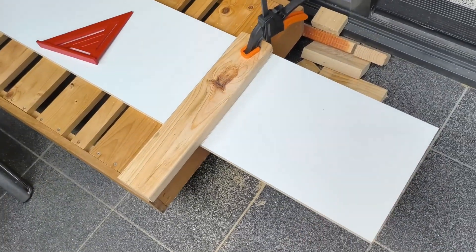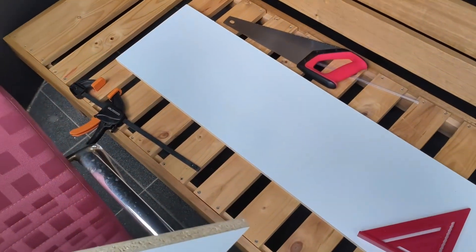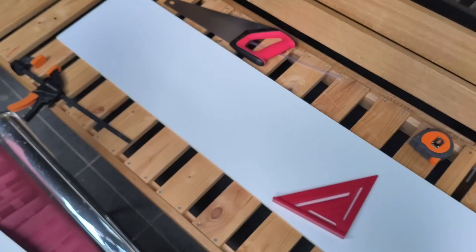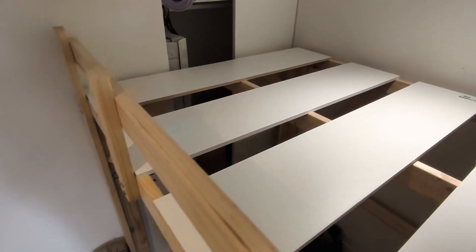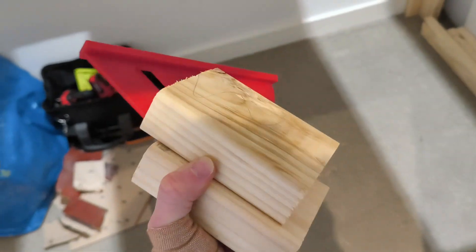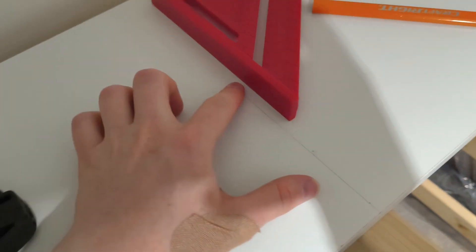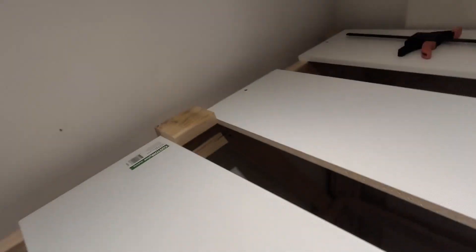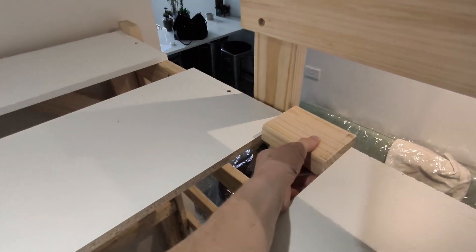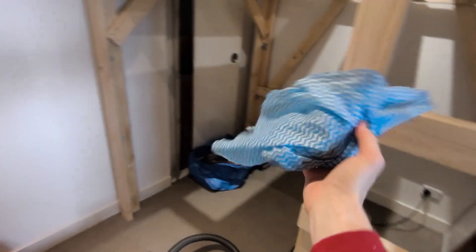I need to cut these sheets of melamine — I had originally thought I'd ordered plywood, but this is basically just chipboard. We'll see how it feels structurally, since the weight will be distributed over a lot of slats, but I don't want someone sitting on just one of them to break it. I've got all the slats put in place, measured and screwed into the joists. I cut two offcuts to 118mm for the slat spacing gaps, then put in one 75mm screw down the centre of each slat — it seems very sturdy. I'm sanding corners with pencil marks and wiping everything down with a damp cloth.